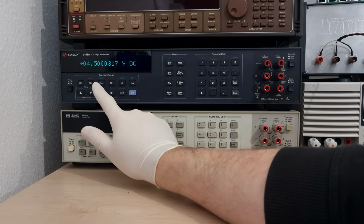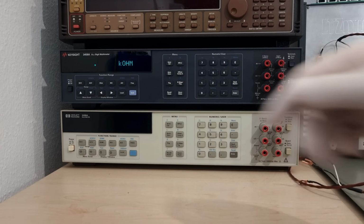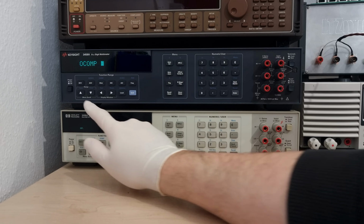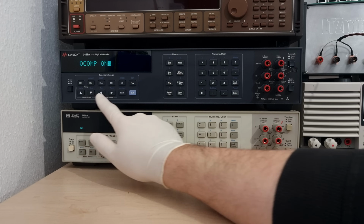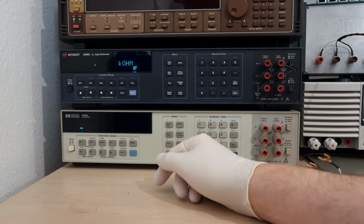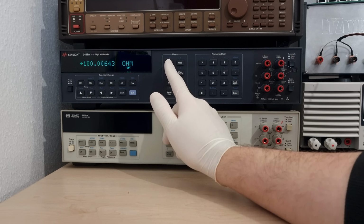In the resistance ranges there are 2 settings one should know about to achieve enlightenment and the highest accuracy. First, a function called offset compensation measures the voltage over a resistor while the resistance measurement current source is still disabled. That first measurement catches, for example, thermal EMFs from the test leads, so that they can be subtracted from the regular resistance measurements afterwards. This makes resistance measurements take a little bit longer, but the higher accuracy is usually worth it.